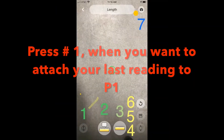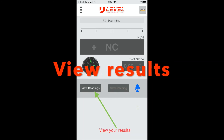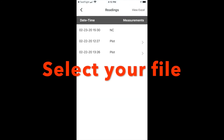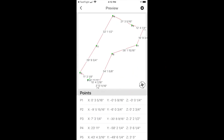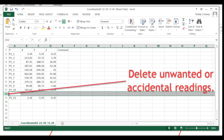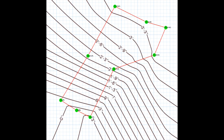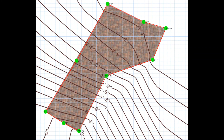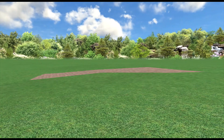What we have now is basically a circuit that we are going to email out. Press on the home screen 'view readings.' You will be able to select the file you worked on at that moment and open it up to see the grid and the mapping. You can send this email version to your phone as an Excel file. It can also be imported as a CSV file. You can delete readings that you want, and you will then recognise the grid, the contours, the elevations — and the final result is pretty reflective of what you measured on site.